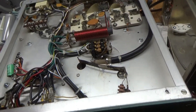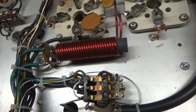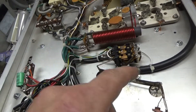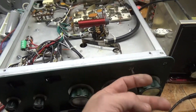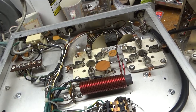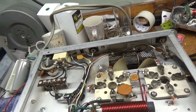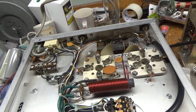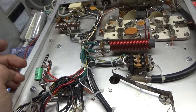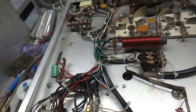Replaced that phenolic piece because it was wobbling around and re-soldered all the leads on it. New wire for the TR relay on both sides — silver plated, stranded Teflon. Zip-tied it so it's not flapping around. Put a new standby operate switch in. Grounded the grids the proper way — not through the screws, not with craft wire. The brown wire is also Teflon wire. Did the bias modification. All the connections are soldered really well, and she's good to go.